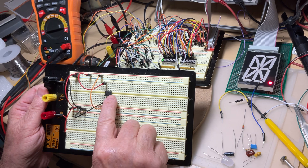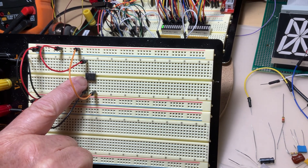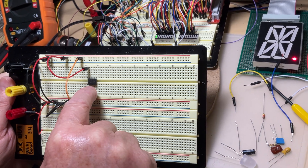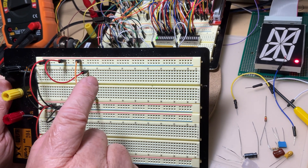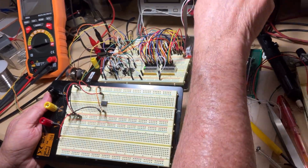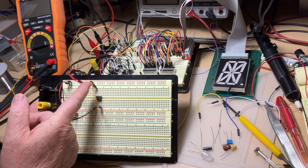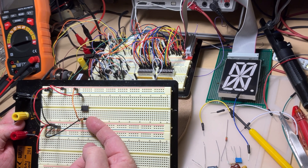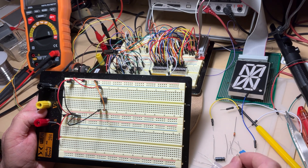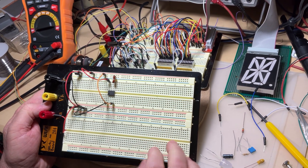An important note: this package is pretty old — designed more than 50 years ago — but still in use today, which is absolutely amazing. Now, one key rule: don't ever wire this kind of thing with the power on. This is why the breadboard is completely isolated from the rest — I can even turn the power off while doing the wiring. To recap: ground is on pin 1, positive 12V is on pin 8, reset on pin 4 is connected to positive. Pin 5, the voltage control, we won't use — we decouple it with a small capacitor to ground.